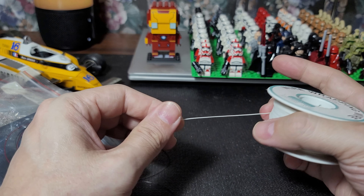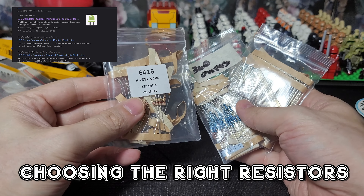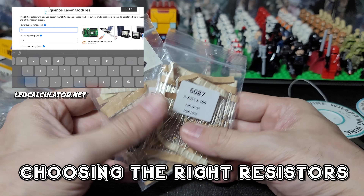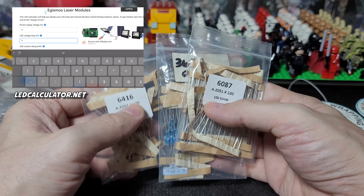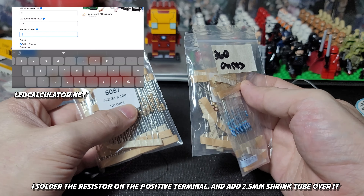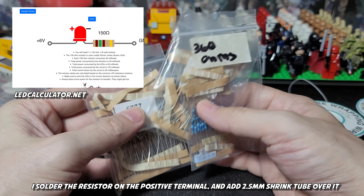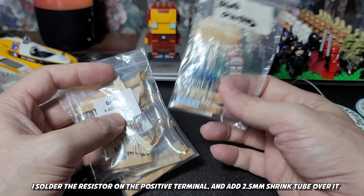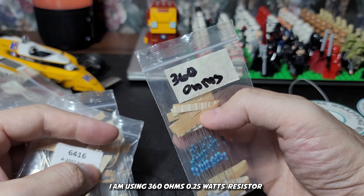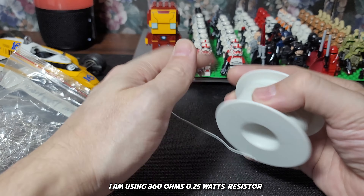With the right capacitor or resistor — there's 360 ohms, 120 ohms, 100 ohms — it really depends on your available voltage. If you're using your radio, there's 6 to 7.2 volts, so make sure you get the right ohms. Just visit an LED resistor calculator to get the right value. If you're running 7.2 volts, at least get something like 220 ohms or 360 ohms. Most of my RCs have 360 ohms, but the calculator may require at least 220 ohms per LED.